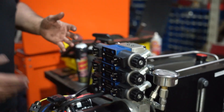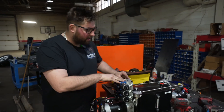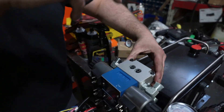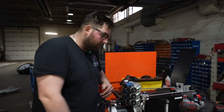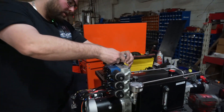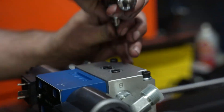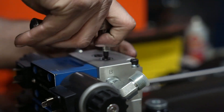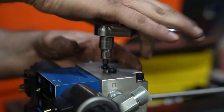So there we go, the logical is already done. Now we're gonna go to the top of the valve stack — there's four Allens on top that need to be loosened, and they have to be torqued when you put it back together, which we will show you. But let's take it apart — grab our Allen and loosen these up. I always like to loosen them with a ratchet first, and then you can put an impact on there.